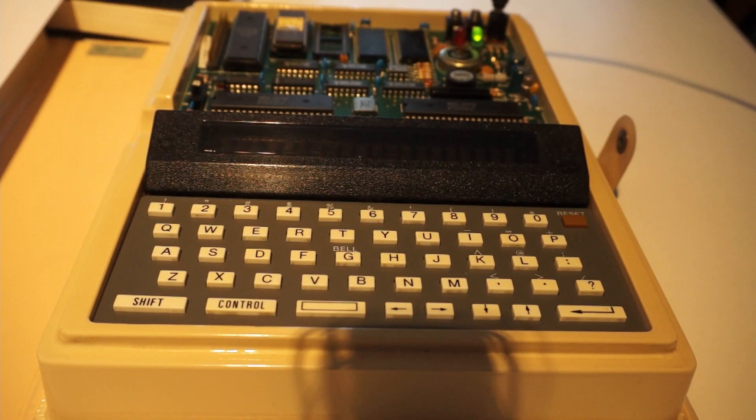During the edit I realized it was beeping every time whether it was showing or not, and I figured that is weird — this worked before when I did the dry run. During the filming I decided to align the string Kellis Coder to the center of the screen, and I'm still checking that first character if it is FF. But even though a space is 32, in screen RAM 32 means show nothing — so let all the transistors conduct, which is FF. So it would always evaluate. I moved the string back to the beginning and then it actually beeps every other time. Never change your code when you're actually filming.